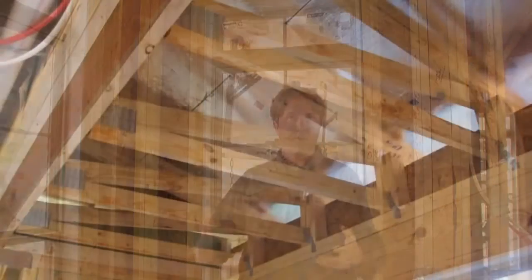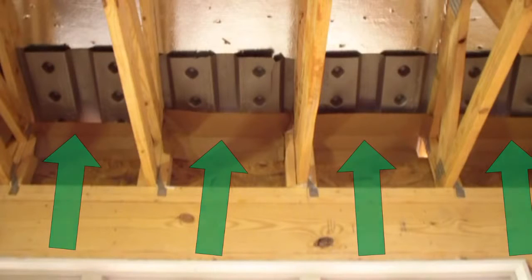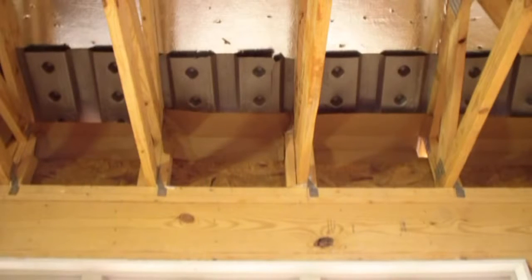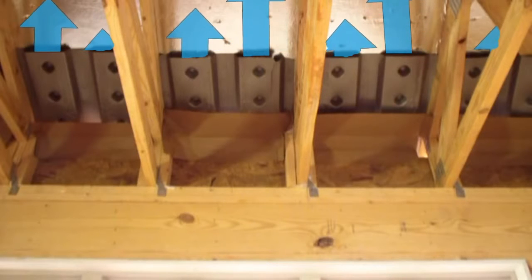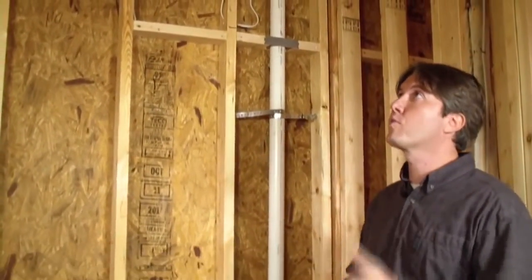Here in the kitchen nook, one of the things we really want to avoid when installing insulation is wind intrusion — air that moves through the insulation reduces its R-value. Above this window we have a vented soffit on the outside, and to protect the insulation from air coming in through that soffit, there is OSB sheathing running up and baffles that the insulation installers pre-install. This ensures that air goes into the vented soffit, up and over the edge of the insulation, instead of passing through it. As we walk through this home, we'll continue to look at the band system that makes up the second floor and separates the first floor from the second.